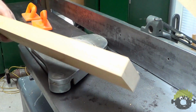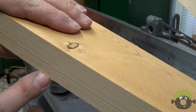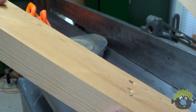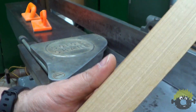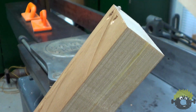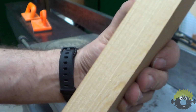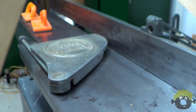I went ahead and did a test pass using the old worn-out knives, and with only 2 of them installed. The cut quality was predictably less than stellar, but even with worn knives and only half of them, the stock moved through the machine smoothly and with a confident level of control. Next step was to replace the old knives.